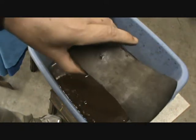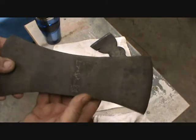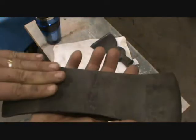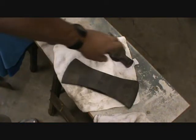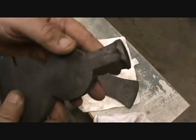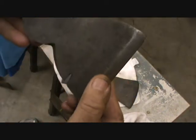Pretty impressed — good little tip. There they are. I've taken them over to the shop sink and cleaned them off, then put a little WD-40 on them just to keep them from rusting while I work on them. I'm pretty pleased with that — it's just a matte, dull finish on them, but it gives you a place to start from. The other two are still soaking, they still had a little bit to go. As you can see, I've got some work to do on this one — somebody's really pounded on it. I'll take a file and straighten all that back out and rehang it and bring it back to life.